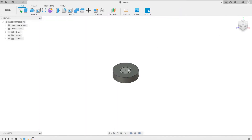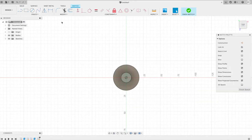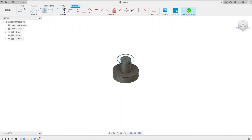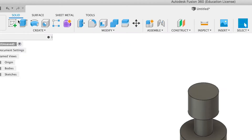I'll go ahead and extrude that out for another 20 millimeters — yeah, that looks better. I'll do another sketch on this to kind of widen out the handle so it fits in the hand a little bit better. I think about 25 should work good. I know it doesn't look like much now but we'll add the fillets so it'll be a nice comfortable grip for your hand.